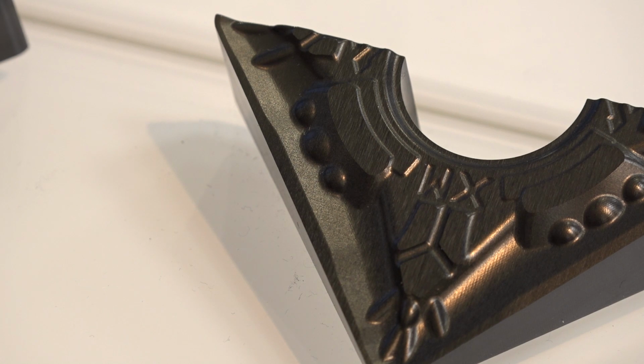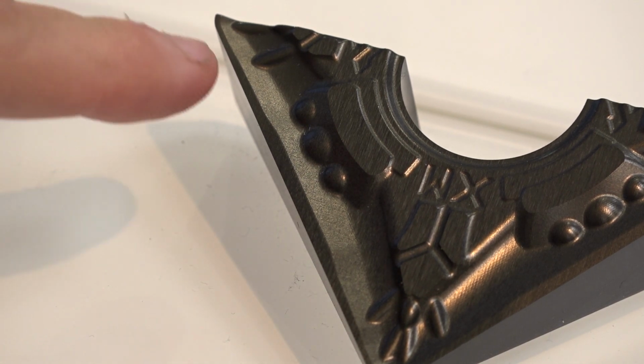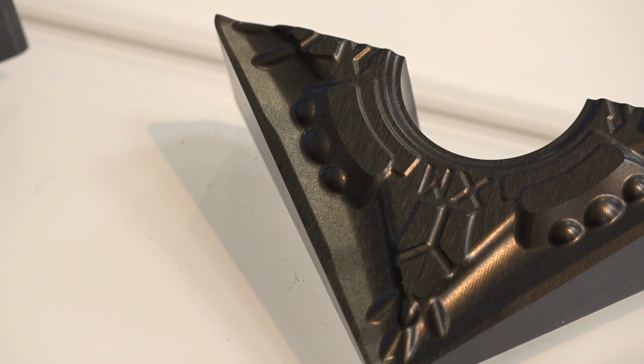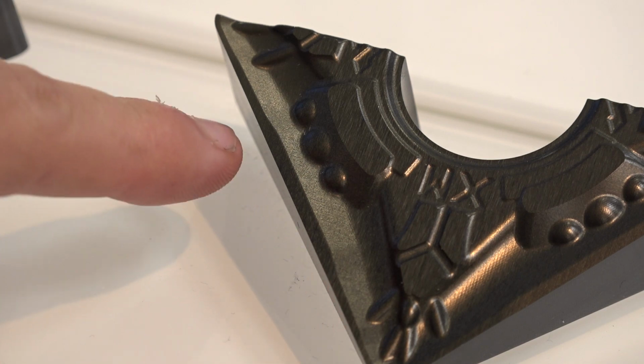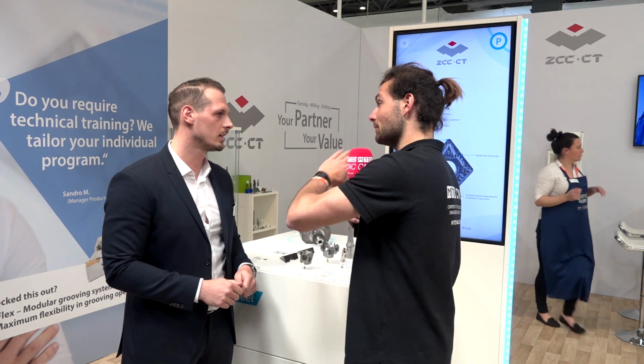Okay, so the T-land is that flat bit on the middle of the tube, in between the two cutting sides of the insert. So when we're looking on the first part of the cutting edge, we have a quite positive rake angle. That means we have optimum soft cutting forces, and the chip control is much easier. We don't build up too much temperature. But after the 4 millimeters, in the medium application, it doesn't matter for us at the end. We got the T-land, the flat one, that we have to be sure that we have no chipping impact damage at the end. So you've got a nice sharp insert edge up to 4 millimeters in from the insert edge, but then the T-land starts, and you've got a much flatter edge, which means you've got higher cutting forces.